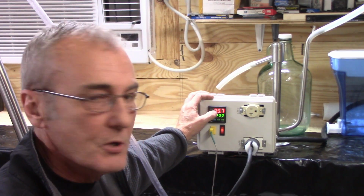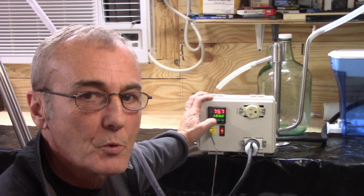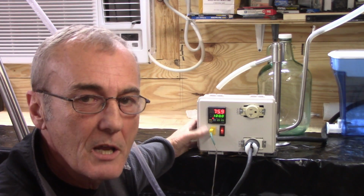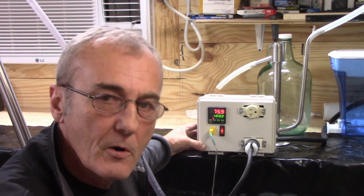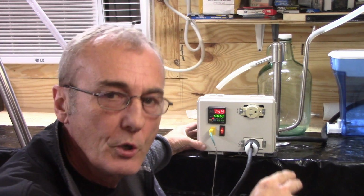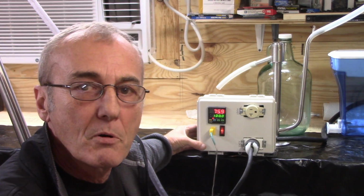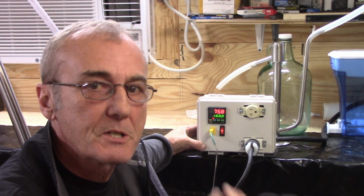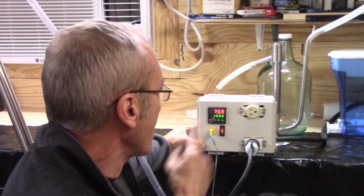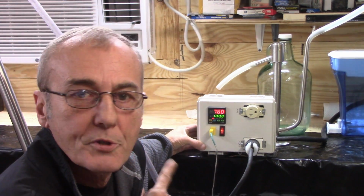As this temperature gets closer to the 110, this will change, and it will change instantaneously. It'll go 90, 70, 100, 30, 50, 22. It'll bounce all back and forth, and that is the PID providing the appropriate amount of power necessary to maintain that temperature. Now, as it goes through its auto-tune mode, this auto-tune will turn off all by itself.